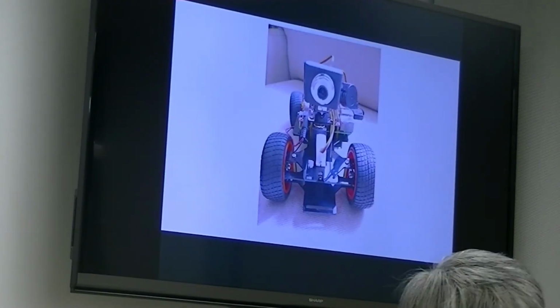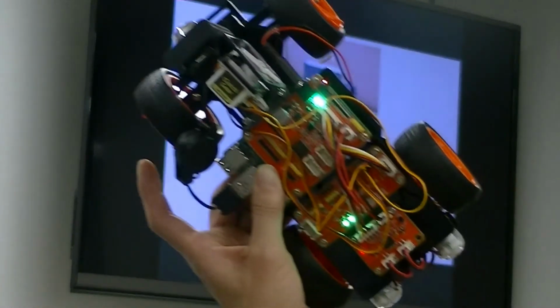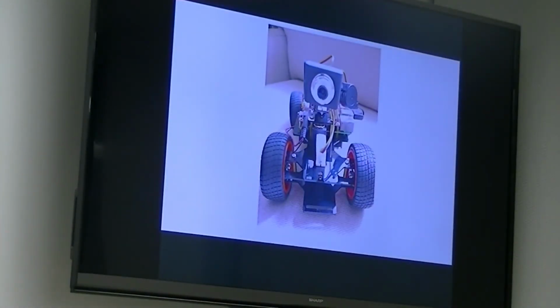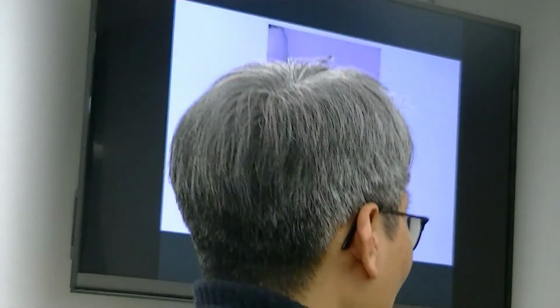And the battery, you can keep the battery in, and if you turn it on, it will power both the controller and the Raspberry Pi. But to save the battery power, you can connect the power to the Raspberry Pi, then the Raspberry Pi will be powered by your adapter. Then you can save the battery. However, if you power on only this one, without the battery power, your controller will not work. The controller needs the battery power for more capacity.